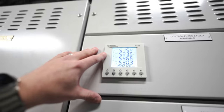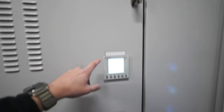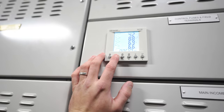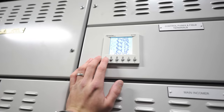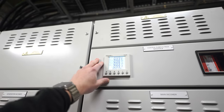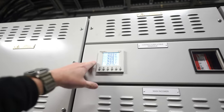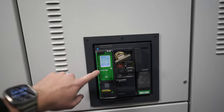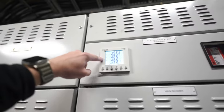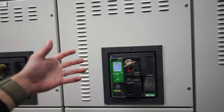There's also these Railie metres everywhere - these are just CT metres basically. You've got the total for the tenants, you've then got the outgoing sub mains for all of the tenants, and you've got the same with the landlord's metre and all the landlord's sub mains as well. You've got panel level monitoring and these are pretty cool - you can cycle through the load, the current, the maximum recorded, voltage, power factor. There's a lot of information here but it's all current, so you can't get a week's worth of data from this and it's just a very basic interface. There's also some discrepancies between this and this, so something's slightly out - I'd probably put money on the Railie. That's why we want to have a look at this, and also why we want to do some proper data logging in the future.